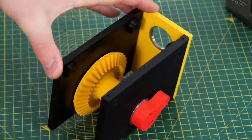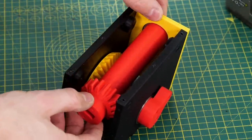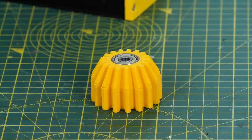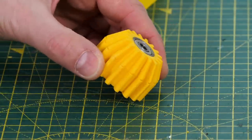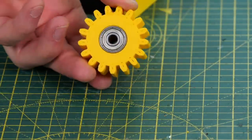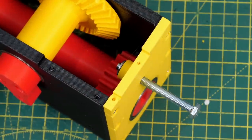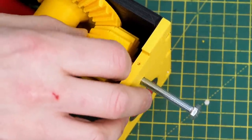On the top of that we have another overhead driveshaft and you'll notice it has a spur gear on it, but that doesn't actually mesh with the bevel gear directly. In order to mesh the two together we've got this bevel gear which is basically attached to a spur gear, and that's got bearings in each end so that it runs nice and smoothly. That fits onto a bolt and meshes the overhead driveshaft with the big bevel gear.